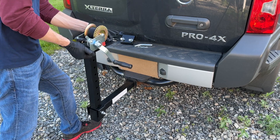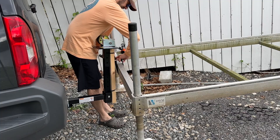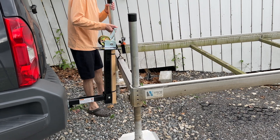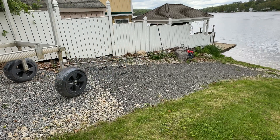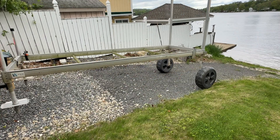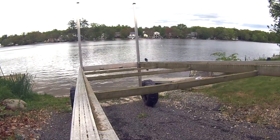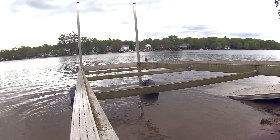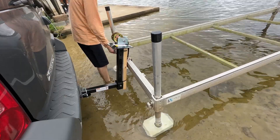I built this trailer hitch mounted hoist that consists of a hitch mount used for mounting a bench vise behind your vehicle. I modified it slightly by drilling holes that fit the hole pattern for a boat winch. The hitch mount has a stated rating of 200 pounds and the boat winch says that it's for pulling but not for lifting. The weight of one end of my dock sections is a lot less than 200 pounds, but any sort of shock force will increase the load, so I'm going to drive this thing around pretty gingerly. Driving the dock sections around is pretty effortless — it's just like backing up and turning with a trailer, but with a little bit of wobbly slop in the movement. I attached a 2x4 to the face of the hitch mount to protect the dock section when it swings into the mount.